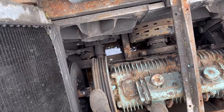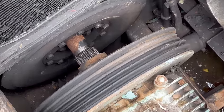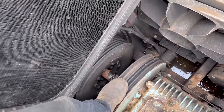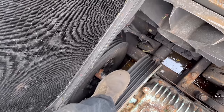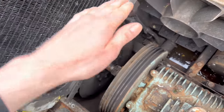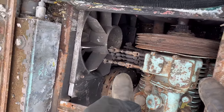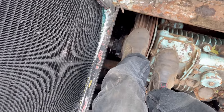they're as free as a bird now. Never ever hit these drums with a steel hammer, because they're cast iron, they just chip and bust off. And those rings that are around them, they're for dissipating the heat, but they're also weighted, so that everything is balanced. So when you smash a great chunk off them, it doesn't do anything any good. But there we go, she's all freed off.